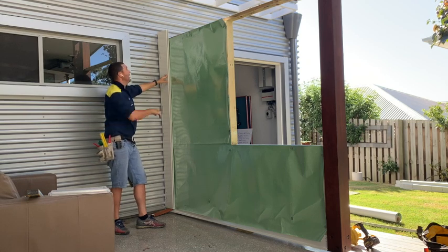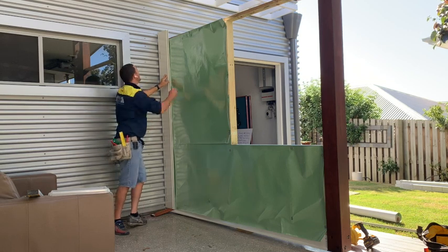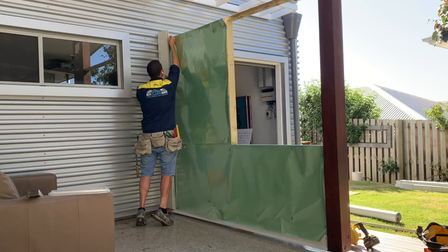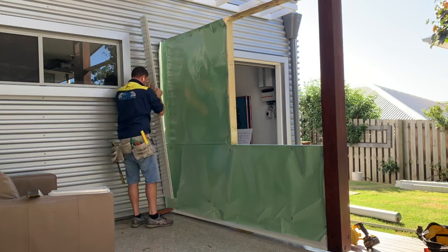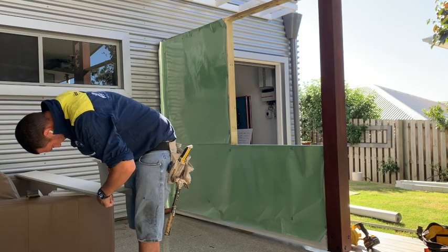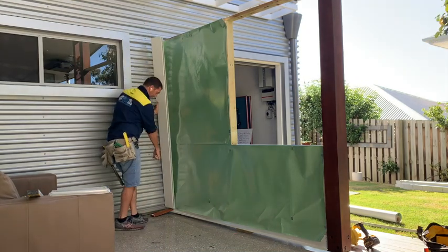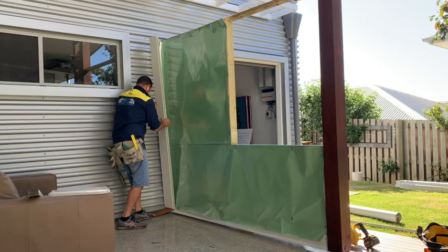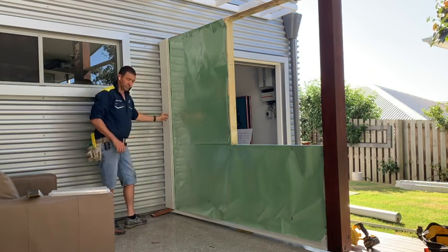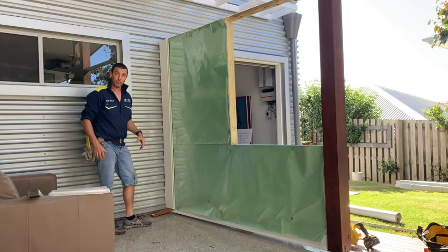I've got my flashing here and I've ordered it longer than what it needed to be. I've fit it into position and I'm going to mark where I want to cut it off at the top — I want to line it up with the top of this frame, just a tad lower. Then I pull the flashing back out, mark it up and cut it. The timber at the bottom will give a guide. We need to get some fixing into this — I'm putting in a small 25mm multi-purpose screw. It does pine, it does metal, though not so good on hardwood.